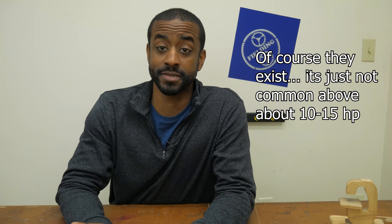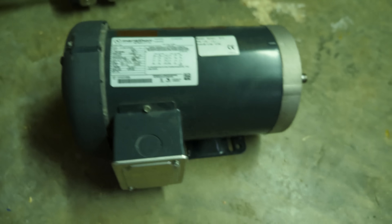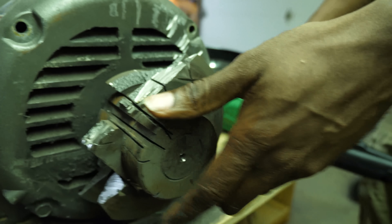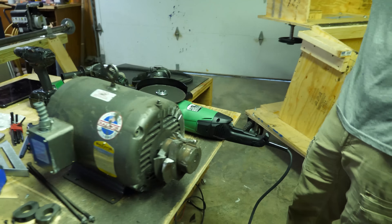At this point I told Destin we were going to have to switch to a three-phase motor. Three-phase motors produce much smoother torque and there are way more options in the higher horsepower ranges — you typically don't find single-phase motors above about 10 horsepower. So I went out to an industrial surplus store and found an old beat-up 10 horsepower three-phase motor and got it loaded up in the machine. We got it for about a hundred bucks, which is pretty awesome.